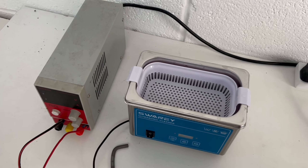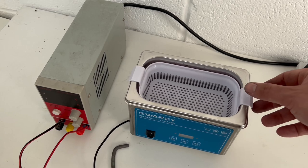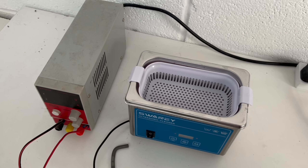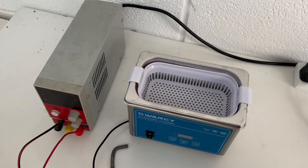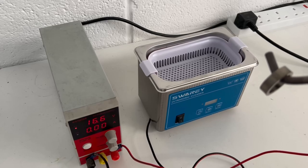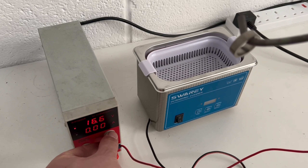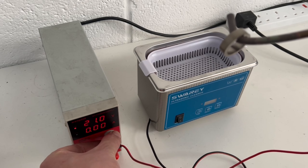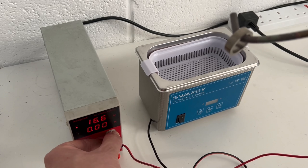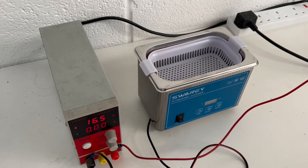As you can see, we now have our negative linked up to the metal case. We have an insulator that just sits in the anodizing solution, which is bicarbonate of soda — sorry, baking powder — and distilled water. All that's left now is to try it. We now have this set to 16.6 volts; we can control the voltage just here, and by doing so that will change the color of the ring itself. It's just a test, so we're going to drop that in there and see what happens.